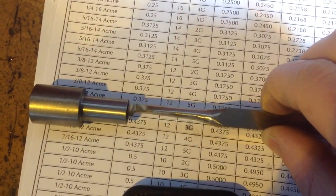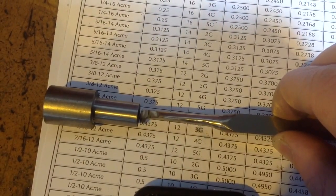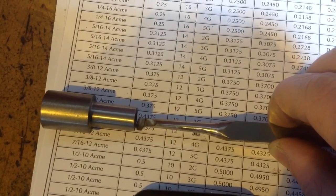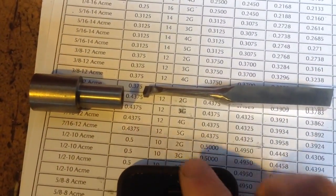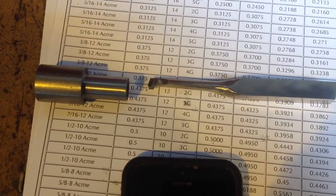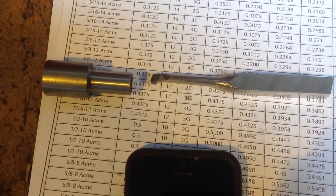Have I given it enough clearance? We'll see, because bear in mind I started off with a cylinder that fitted down here. When I take a cut like that, the middle part is going to move into a smaller diameter, so I'll probably have to take a little off the top and bottom. But okay, let's get this end here close to 32 thou, just with the verniers and the grinder, and then we will pop it in the lathe and do some honing to try and get the angles really nice.